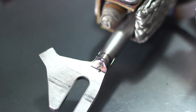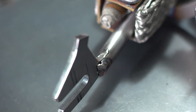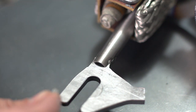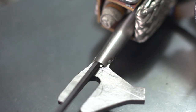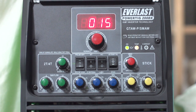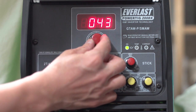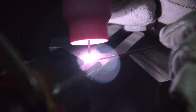Alright, so there I go — I just welded that on there. I didn't really need to use pulse, and in the future I don't think I will. I got a little hole there — it's just not necessary, I think. So I'm gonna fill this up; I'm gonna try to run a single weld right across that hole, and I'm going to put a little cutoff piece in there to help fill it. My pulse settings — I'm actually turning pulse off, and from here on out I will not be using pulse.